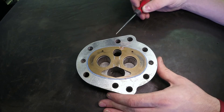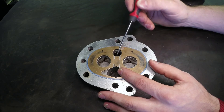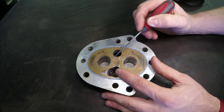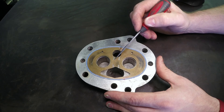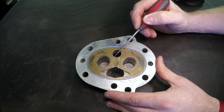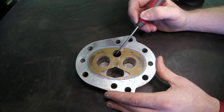So we can see the large inlet, the small outlet, the pressure plate, and the high-pressure seal pack pushing the plate up. We can also see these cut grooves right here to prevent over-pressure inside our case. As these gear pockets close, a small pocket of oil gets trapped — as we looked at in the other cutaway diagram — and these grooves allow that oil to exit and leave out instead of pushing the two shafts apart. It cuts through this groove into the outlet side.